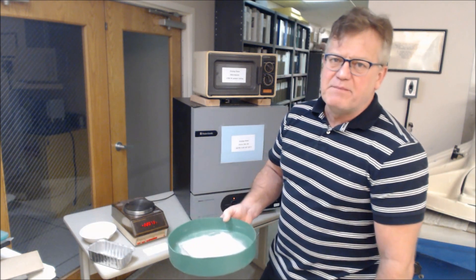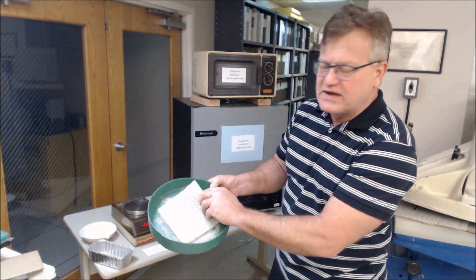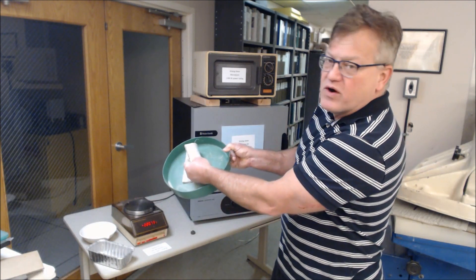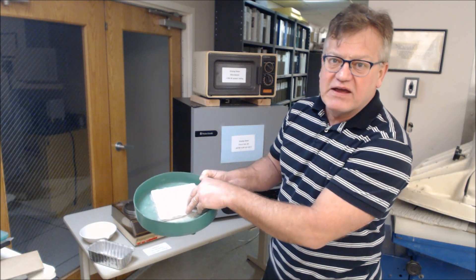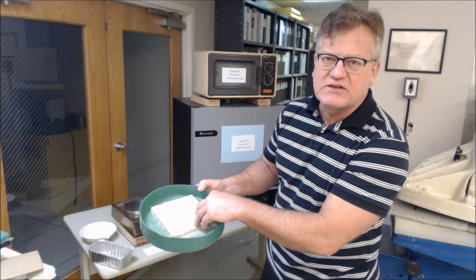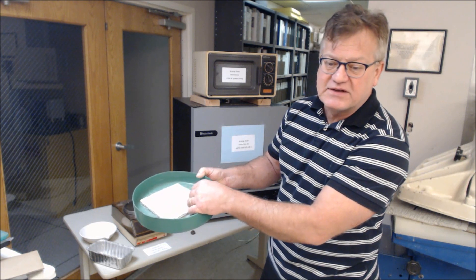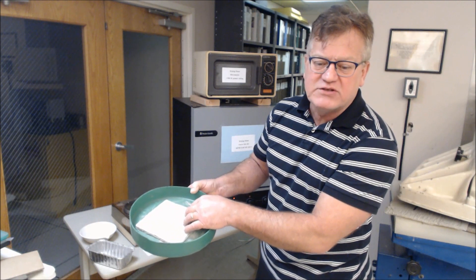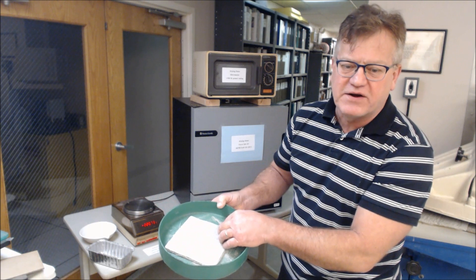What you'll also need from this is the mass per unit area of the geosynthetics which are attached to the GCL. In this particular case, there's a woven on one side and a non-woven textile on the other, which has been needle punched together. The mass per unit area of those components are typically given to you by the manufacturer. These particular textiles are in the 6 to 10 ounces per square yard range — in the neighborhood of 200 to 350 grams per square meter.